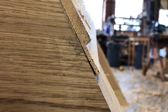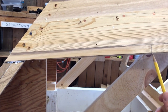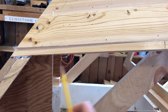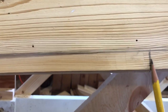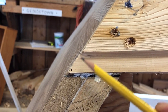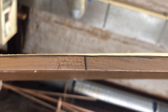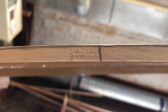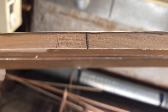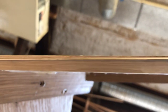Our last plank needs to have a gain cut to match tightly into this one. All the gains on the boats in this shop are 16 inches long from beginning to end. They taper from nothing down to 1 eighth of an inch on the inside and 2 eighths of an inch on the outside. Looking at the gain from the edge, you can see that where the vertical line is, there's nothing taken off, and it tapers down to the end — a nice, even taper.